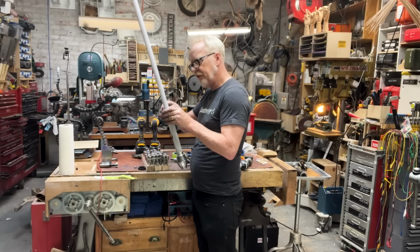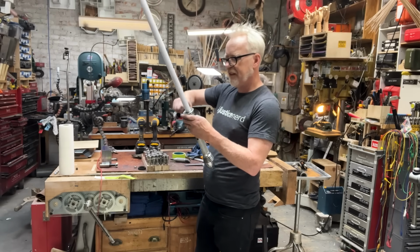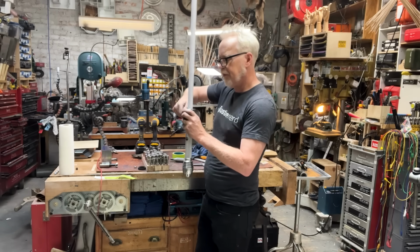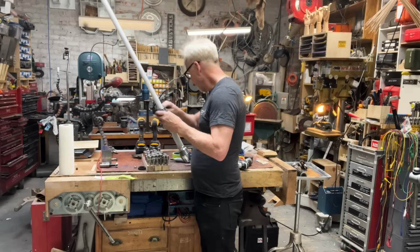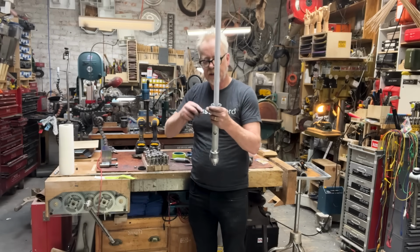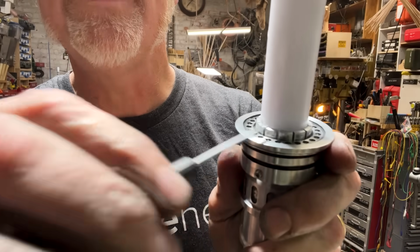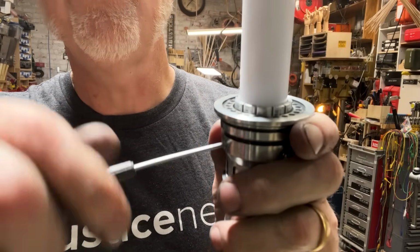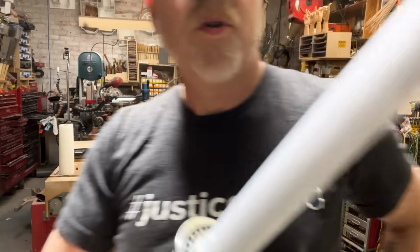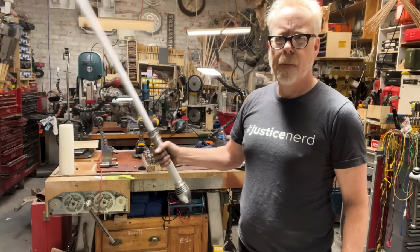Again, these are 8-32 set screws pressured against a kind of internal collet I've placed at the emitter that should hold on to this plastic blade with a lot of force, a lot of grip. I've got a lot of surface area instead of just little set screws, right? And my set screw is pressing into that leaf right there. And so that leaf is grabbing this thing on a much more positive basis. You won't go any farther.